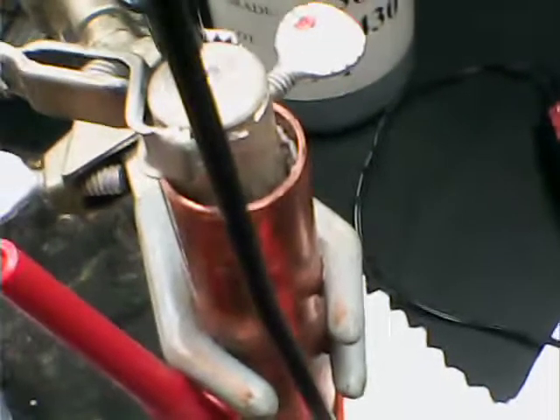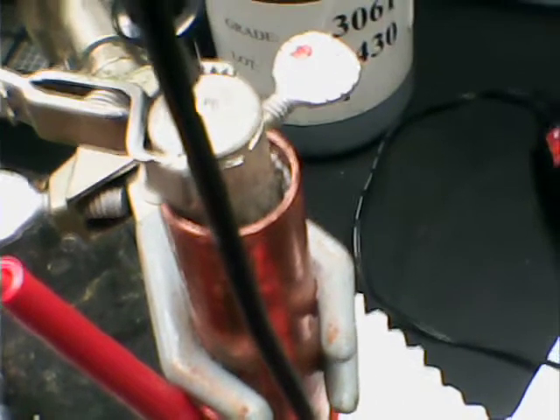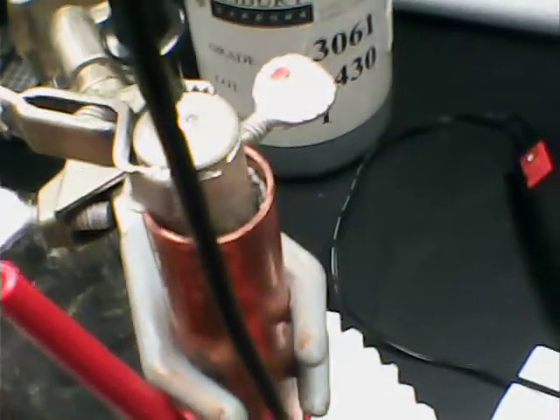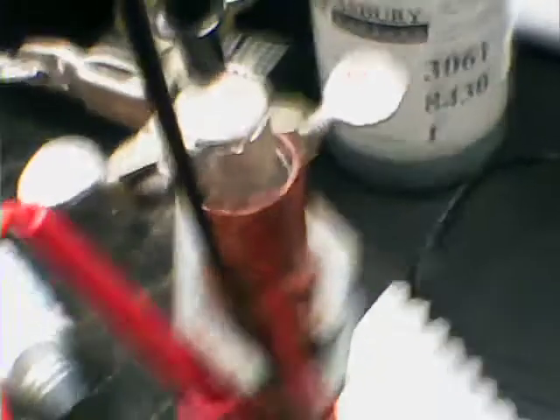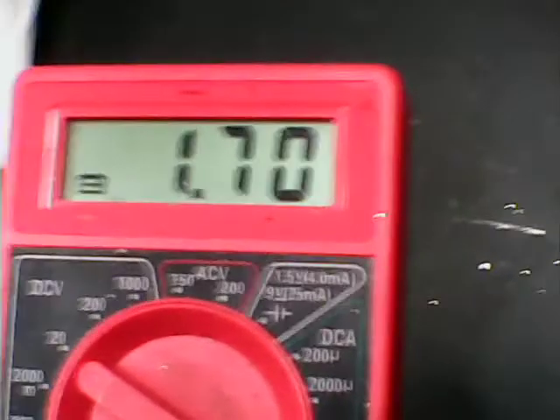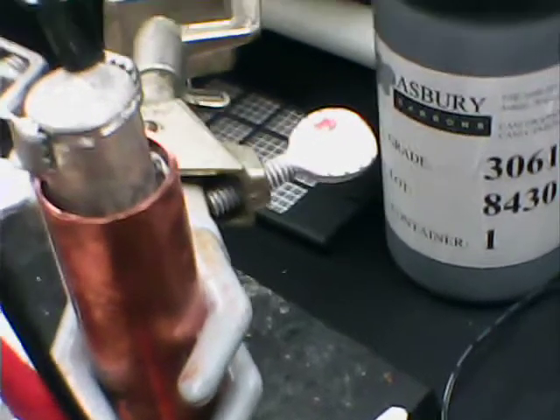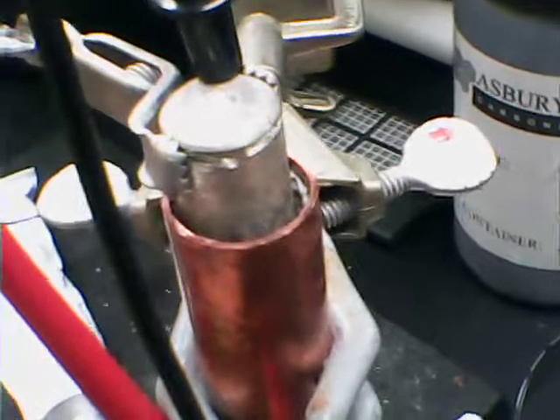What I have here, instead of having copper wire wrapped around a rod of magnesium insulated by some type of foam — that's a conventional Dickens cell placed in a bath of water with or without electrolyte — I'm getting 1.70 volts here. My reverse Dickens cell is basically a piece of hacksawed copper, about an inch outside diameter if I had to guesstimate, and a rod of magnesium that I get from eBay from China.